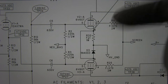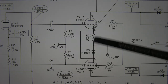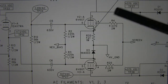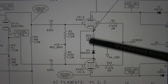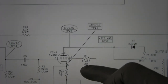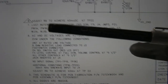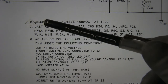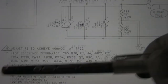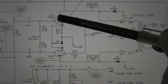What interests me: you can see negative bias here and the cathodes are connected to ground — it means it's a fixed bias amp. So you have to be able to set the bias. What Fender did here is add R20, which is a one-watt, one-ohm precision resistor. That way you can measure the voltage drop across this resistor. Fender tells you that you need 40 millivolts DC, and you have to adjust R6, a potentiometer, to achieve 40 millivolts DC at TP22 — which is the cathode from the 6V6.